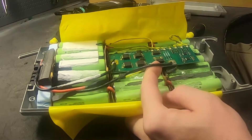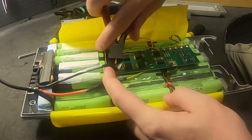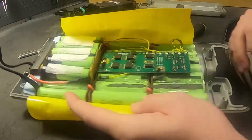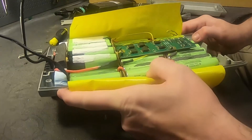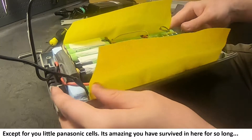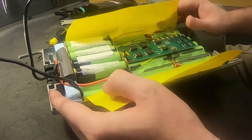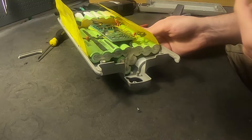Either way you should not accept this unless you have a lot of spare time — just gluing them together, and these fillers. If they did the case, why are they adding these stupid fillers that break and leave a lot of dirt in the case? Why didn't they just make it a little bit smaller? Everything in here I hate. But of course it's possible to repair. There are only two pins for discharging and this mess for charging. It's not well protected against water and not well protected against bumps.